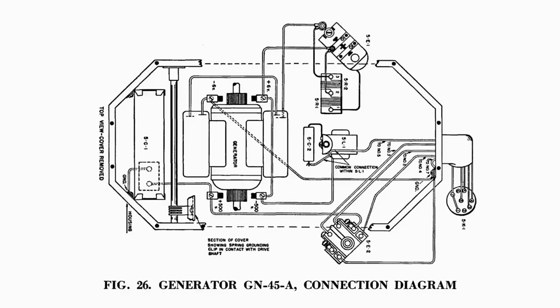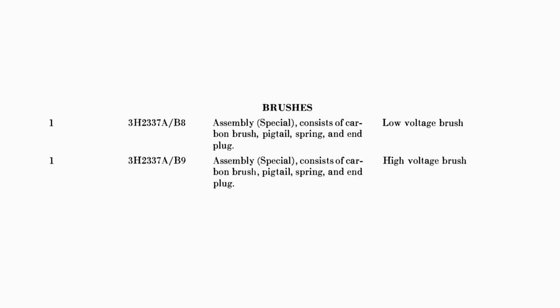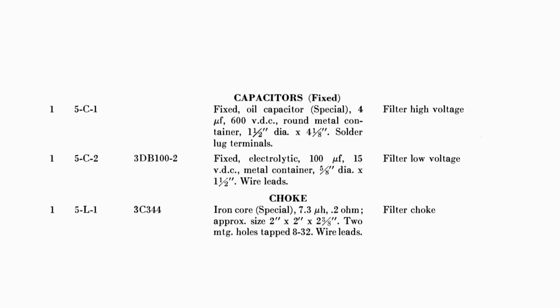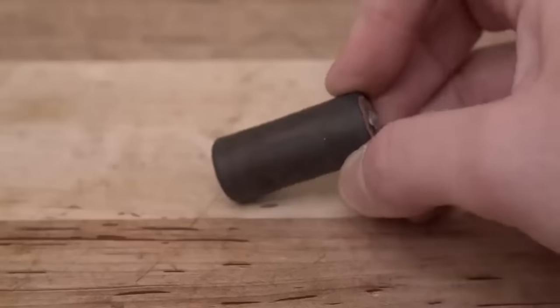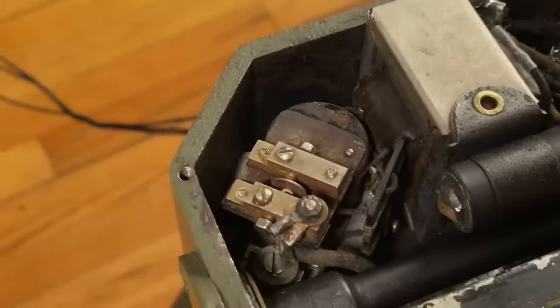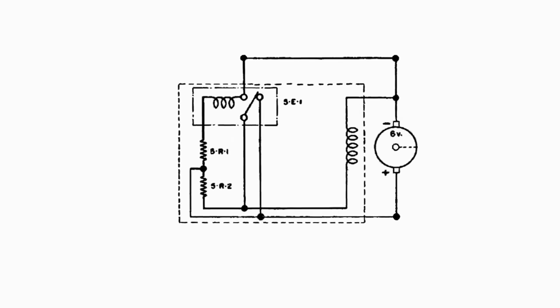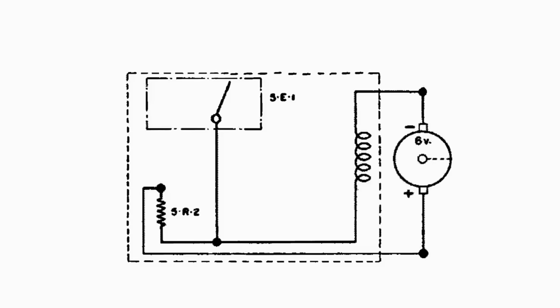The two sets of commutators conduct two sets of voltages: a 6-volt supply for the transmitter filament and a 500-volt supply for the transmitter plates. The generator has a filter system - just passive components including a choke and a capacitor (an electrolytic capacitor on the low voltage side and a large paper cap on the high voltage side) - which smooth out the rough signal. The final part is an electromechanical voltage regulator, essentially just a relay implementing a closed-loop voltage regulator using only mechanical parts and electromagnetism.